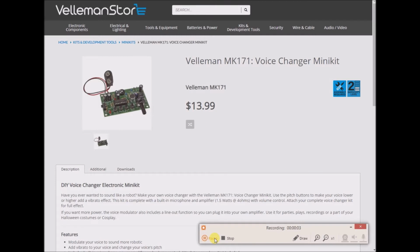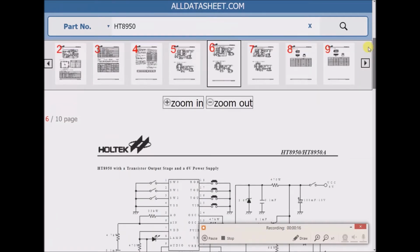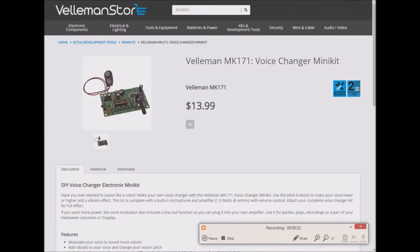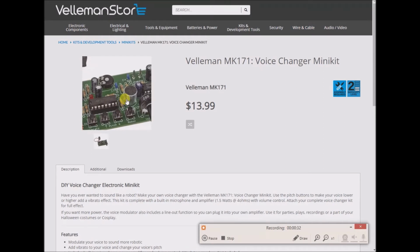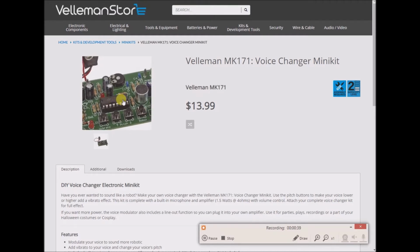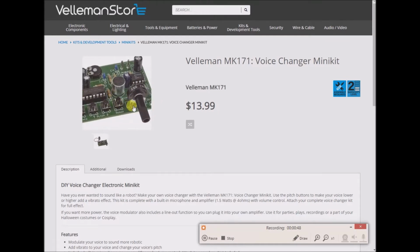Alright, okay, so this is an unlisted video on my channel. I am currently trying to decide on what circuit to build for this HT8950 voice changer circuit. Now, Velleman also makes use of this particular chip in one of its kits, and I just wanted to look and see what they have to say about this chip. Mind you, I'm looking at it right away, and I can see that it's the 8950A chip, which is the 16-pin chip, which unfortunately is not the one I'm using.